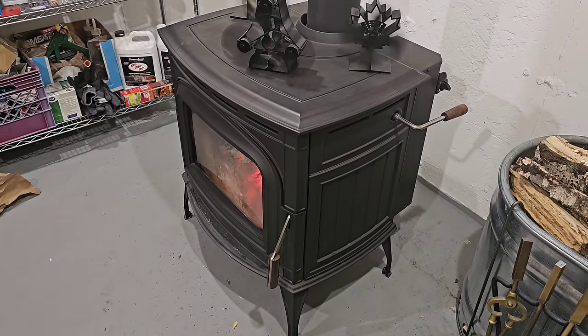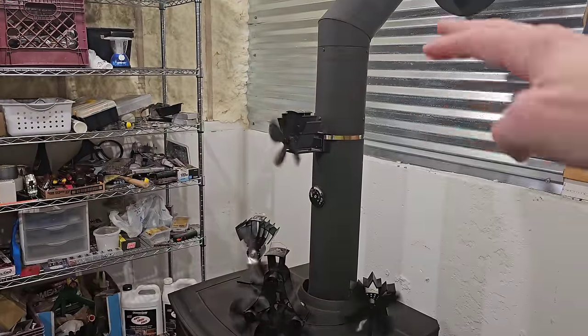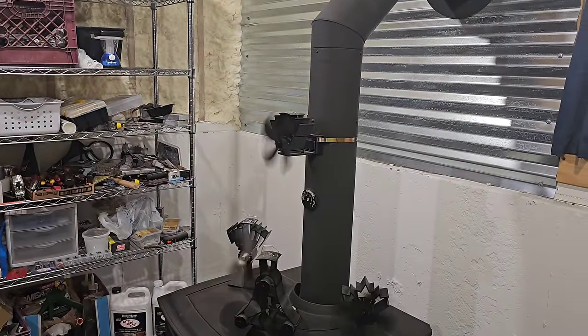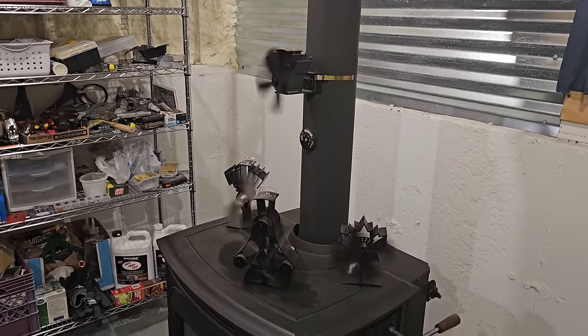You could attach a normal old-fashioned damper to run it in an emergency if you absolutely had to. Dampering it like that will cause damage over time because the stove isn't meant to run that way, but you could in an absolute emergency. I'd rather keep a $10 damper for emergencies than a spare catalyst, since the catalyst is about a $600 part. You can go to Home Depot and get a cast iron damper for around $10.